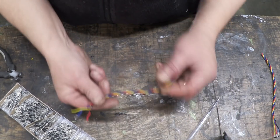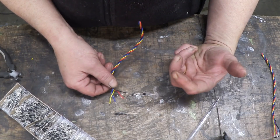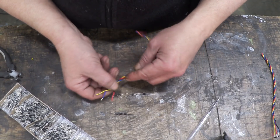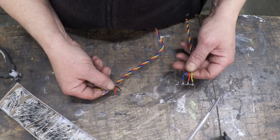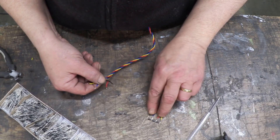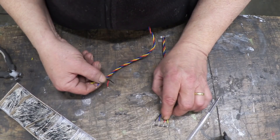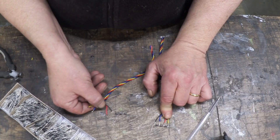To make this we're going to use four wires and connect those wires up to the capacitors. In order to put 64 capacitors on our fractal net, we need 32 of these, because each one takes two capacitors. We solder the same wire in the same place all of the time. Here's an example of one that I've got ready — position three is red and position four is yellow, and I need to solder them all the same way every time.